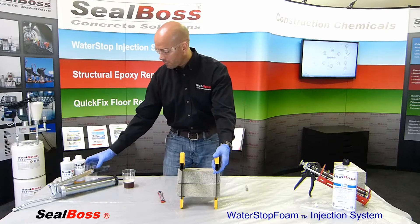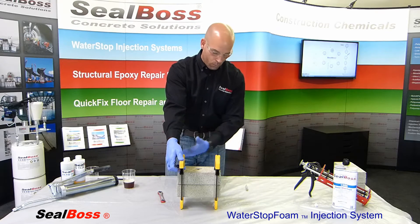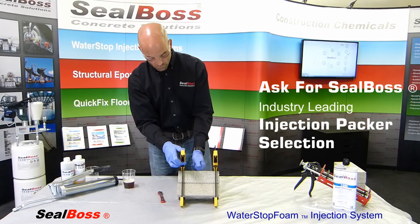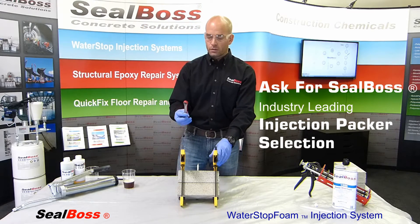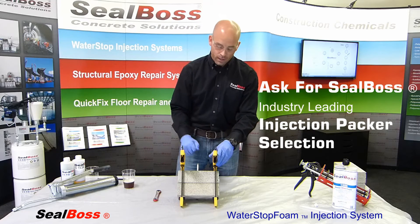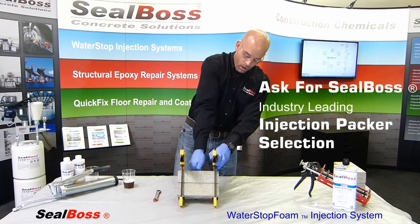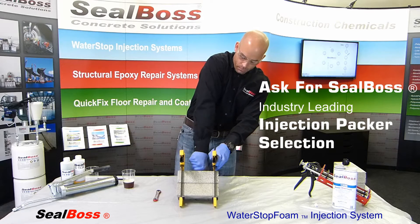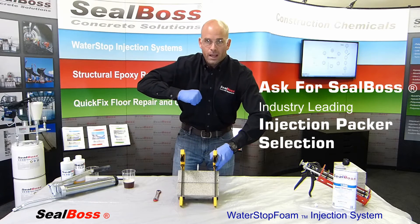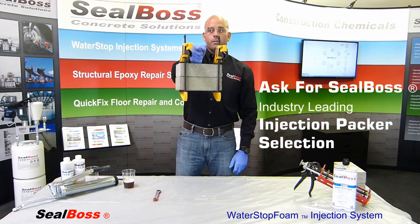It does not take a lot of water for the reaction to occur, so I didn't put a lot in. That water is now percolating down and permeating to the plane where the two blocks meet, and now I'm going to go ahead and set the mechanical injection packer. On a job site you'll typically tighten down on the stem of the packer with a tool or a pair of pliers — I'm just going to do it by hand. As I tighten down on the stem, there's a compression disc on top and one on the bottom sandwiching pieces of rubber together, causing them to swell outward and lock into place within the drilled hole. The result is a packer that stays in place.